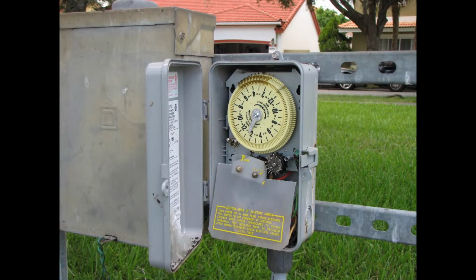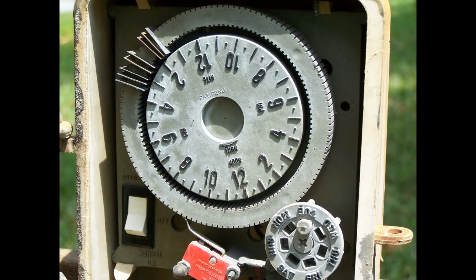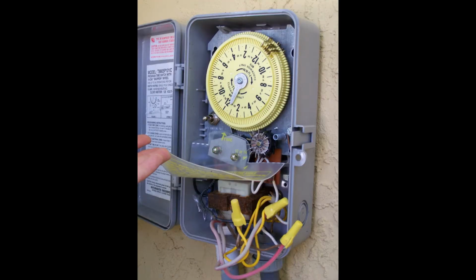Another problem with the indexing valve is the clock that's associated with it. Generally, there's a mechanical timer that goes along with it. This can only be programmed in 12-minute intervals, so you can either go 12, 24, or 48-minute run times. But this isn't necessarily ideal for all irrigation zones. Some zones only require maybe 5 or 10 minutes.